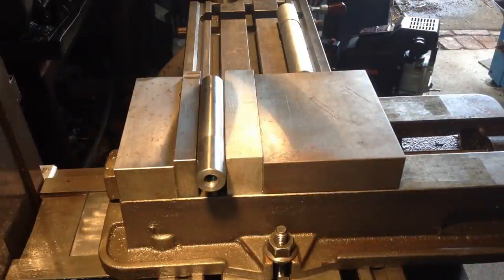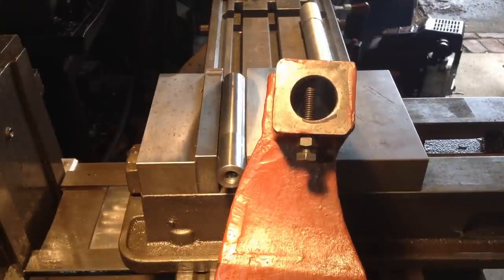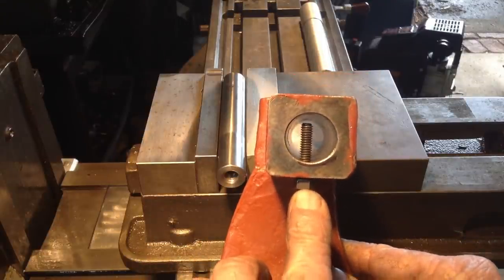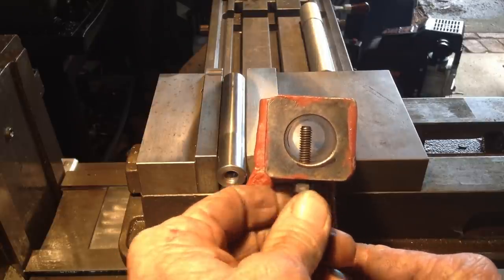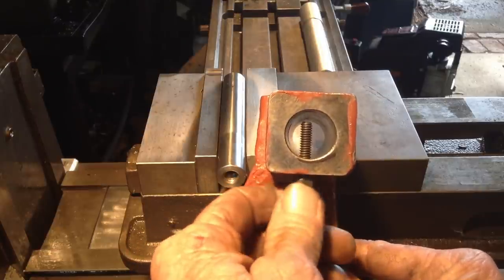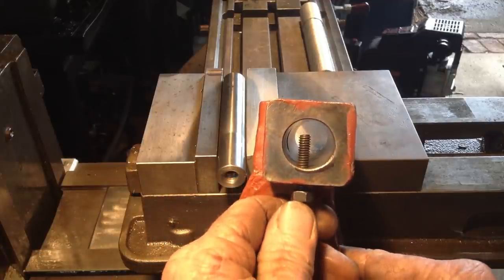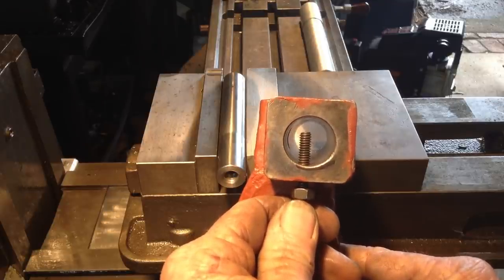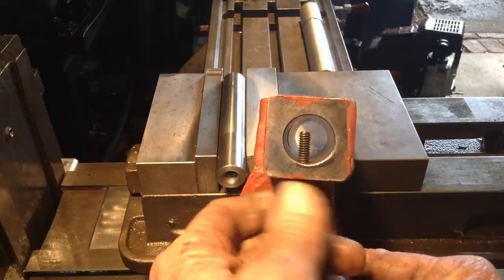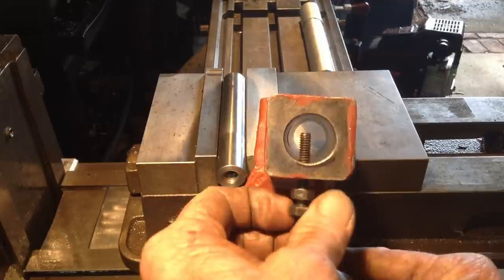Okay, we'll get a cutter set up and put this key slot in. There's some funky goings on here with this tailstock, because I just put a bolt through to have a look before I cut the keyway, and as you can see, it's a mile off centre. So I'm still going to cut our one on centre, and we'll just file the end of the dog point screw to suit. I don't want to start cutting ours off-centre, because it'll look weird. Someone will pull it out one day and wonder who machined that. So I'm going to cut ours on centre, and we'll modify the end of this screw into a dog point screw to accommodate it.